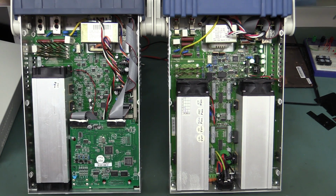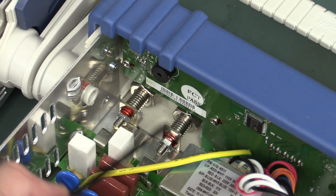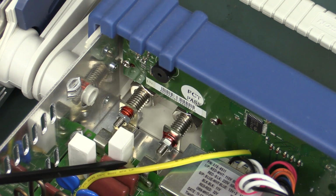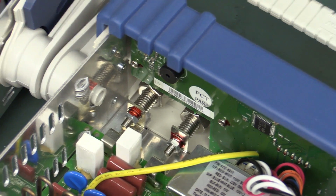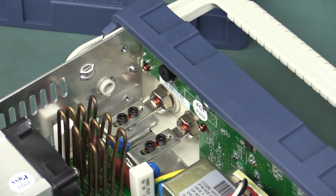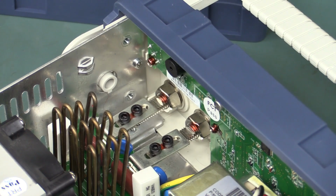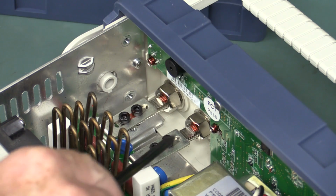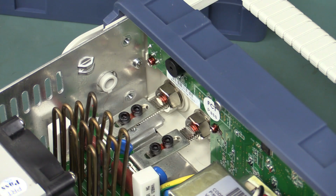But yeah, there's lots of attention to detail in here that make this a real high quality unit. And I'll point out a couple of features. If you have a look at the old model with the binding post interface, it's just absolutely gorgeous. Everything's Loctited up. They've got specific custom bars going over to the PCB here, and very similar on the new one. Check it out, a few differences, but yeah, very nice dual nut tie down here for the bar that directly comes out from here, all custom machined, all custom made. Just gorgeous interface, exactly what you want on a real high quality, high current unit like this thing.